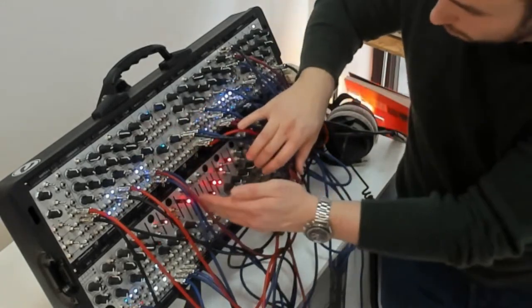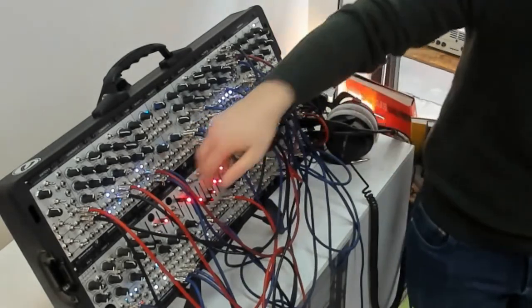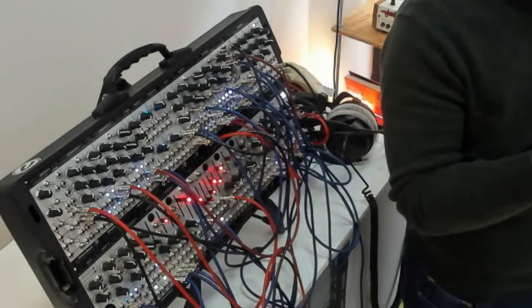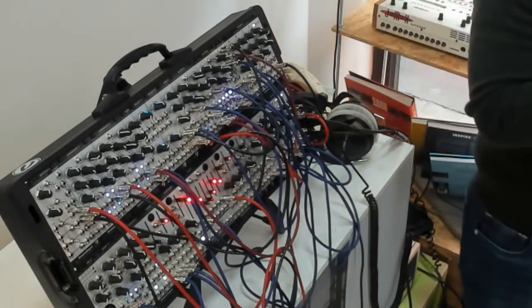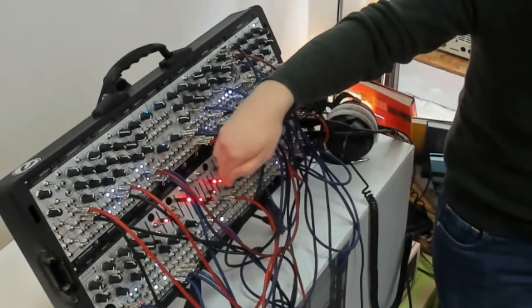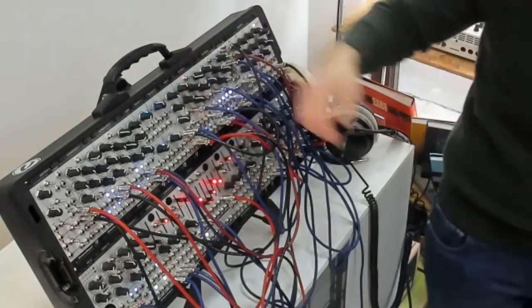Now you'll see that all of the output voltage LEDs remain lit. What happens here is that I've activated the hold circuits on the outputs, and this is a difference compared to a normal sequential switch, where you don't have this hold feature. Now all of these voltages remain stored until the register returns to them and refreshes the memory following this input, which of course can change.